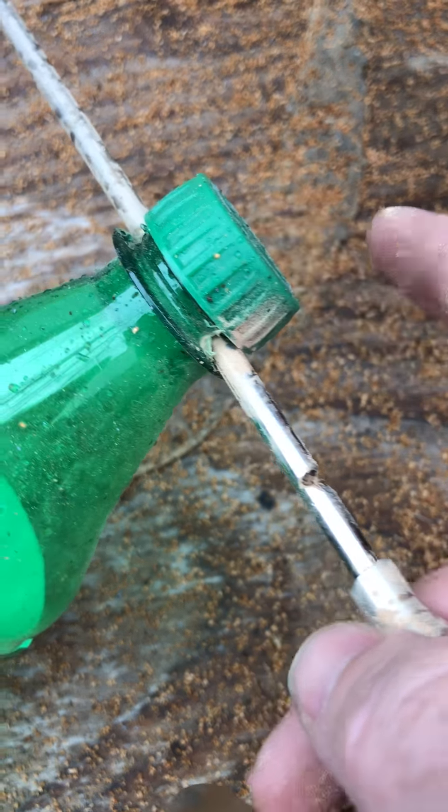There are a few areas where it didn't get, but I am using the fine walnut media from Harbor Freight, not the coarse, because I don't want to thrash the metal. And then that area right there, all I did was hit it with a little bit of, I think it's 130 grit, just regular everyday sandpaper.